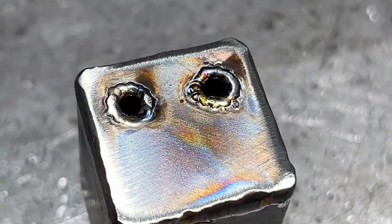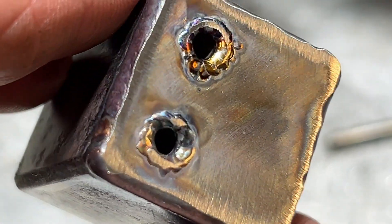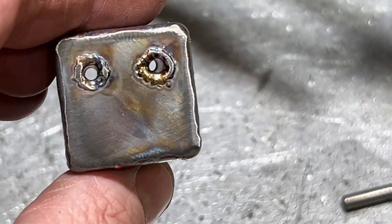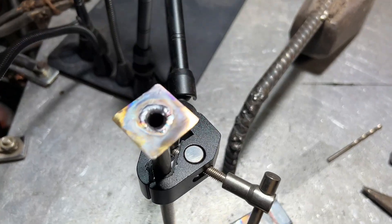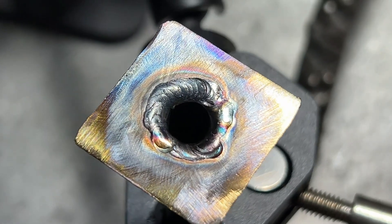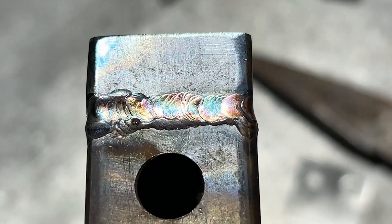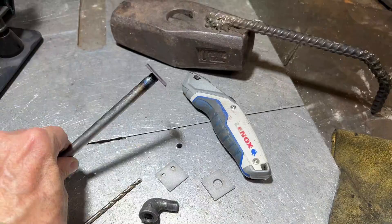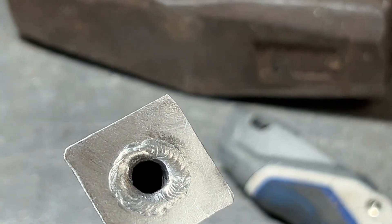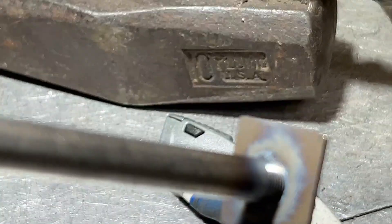Normally I would braze these but I'm giving this technique a try. If it leaks I'm in a lot of trouble. I'm not done yet — we got a little bit of alignment to do yet. No filler metal on any of this. I might walk around that one more time. It is hot. All right, so there it is — no filler metal. A nice small leak-free weld. I did cook it, I cooked it, but it's going to be okay.